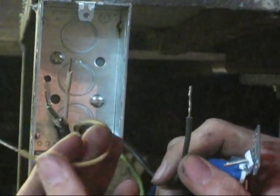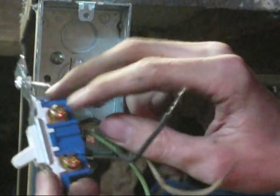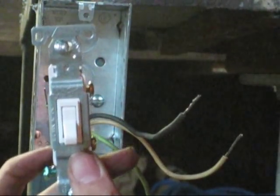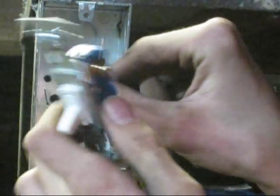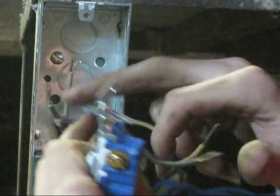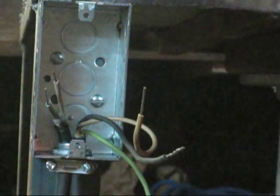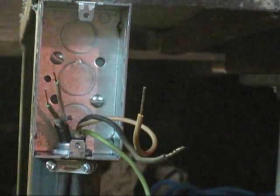What you're going to do is take both of your black wires and attach them to the two terminals on your switch. When you do that, that'll put power to your blower whenever you have your cable hooked up. Your two white wires — your two neutrals — will be tied together; you'll tie them together and take a little wire nut and twist it on there. Finally, both your green wires will go to your ground. Most boxes have ground already inside of them, but this one doesn't — that's fine, because we have ground here on the side of our switch.